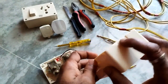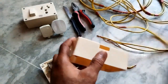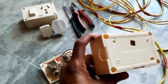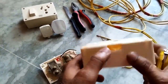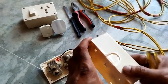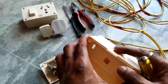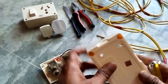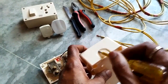This is the box. There will be four sides — one, two, three and four. For taking the wire through this, you can see there is a gap here. You can break this side easily. Whereas on this other side, you have to make a hole because there is no gap there. Where you find a gap, you can break easily.